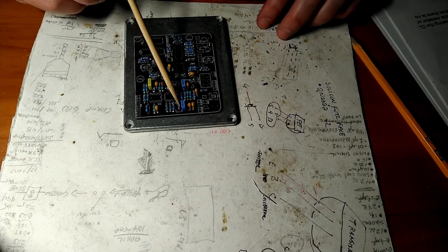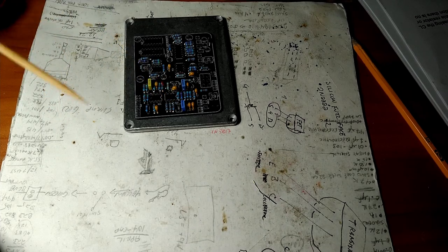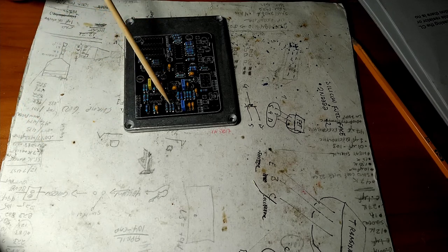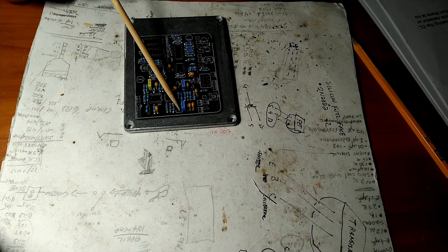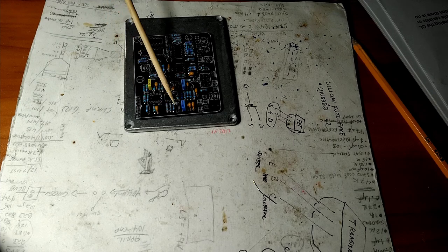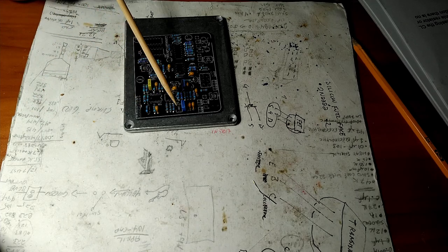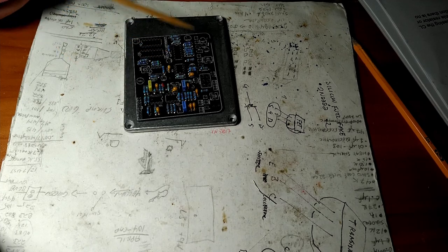They do have one box capacitor here. This is a 1 microfarad. It's a non-polar capacitor. 1 micro is, relatively speaking, a big value in this application. I don't know how to explain it, but it's big for a non-polarized, non-electrolytic capacitor in this application. I really don't know what the difference is between ceramic, poly, and the features and benefits of each. But here we are. So we've got to get this 1 microfarad poly box in there, and then we're going to move on to the electrolytics.